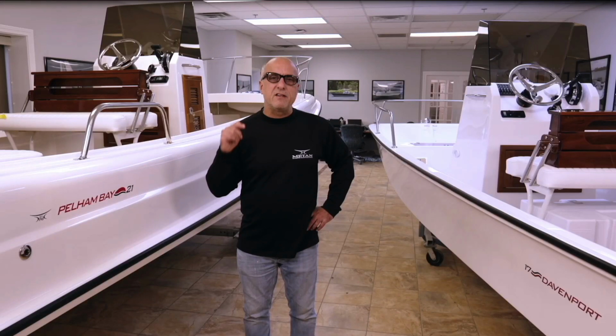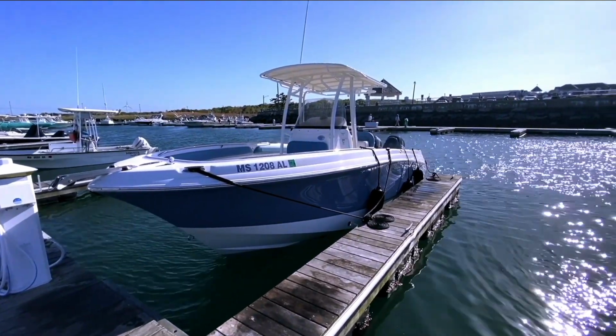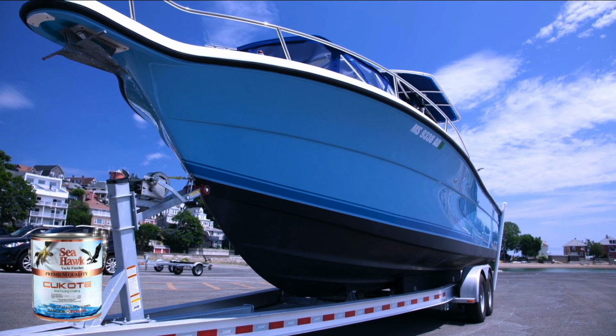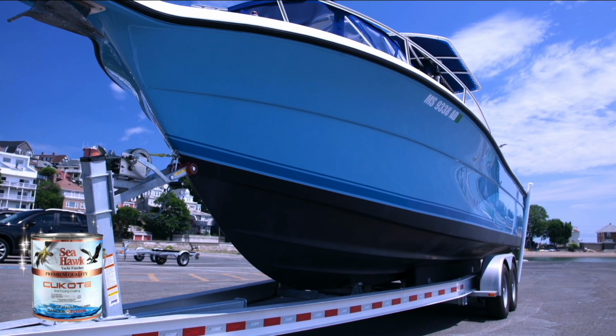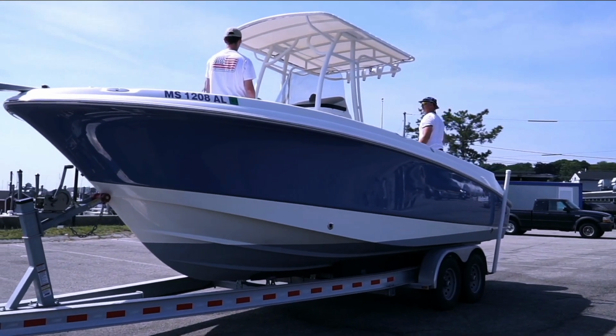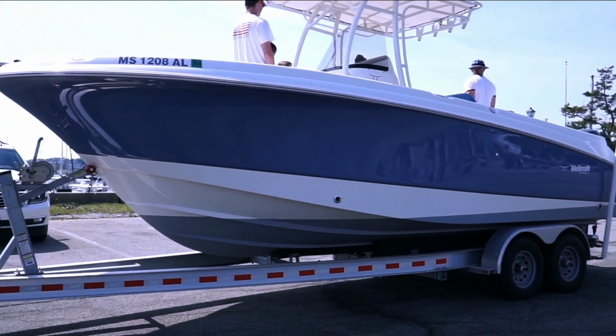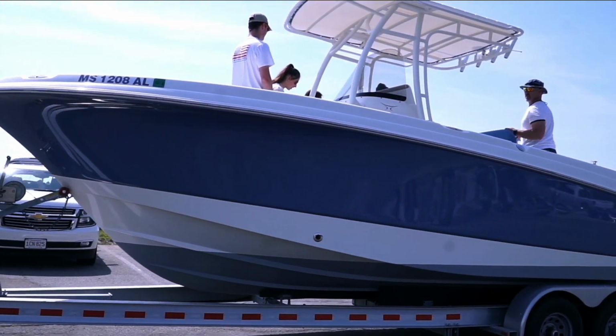For the boats that may end up staying at the mooring or tied up at the dock for an extended period of time, they incorporated 3 biocides into the product. For years, we used a True Coat product that used the same ablative technology with only 1 biocide, and the stuff worked brilliantly. So one could only expect even better results with this product over time.